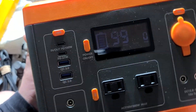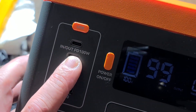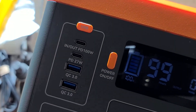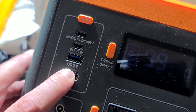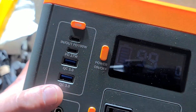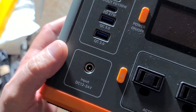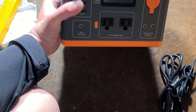As far as charging devices, that's probably what it's best for, because it has a 100 watt USB-C power delivery port that you can charge from, as well as a couple of Qualcomm Quick Charge 3.0 compatible ports and a 27 watt output-only USB-C. Of course it also has a DC barrel jack input, which you can use with solar panels — just don't exceed 24 volts or you'll blow out the input stage.